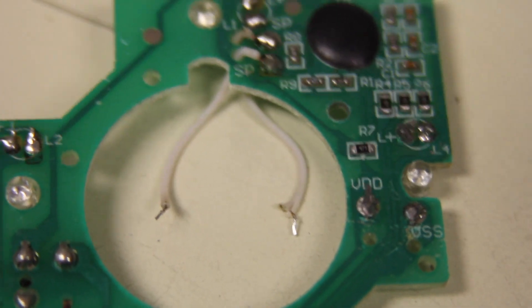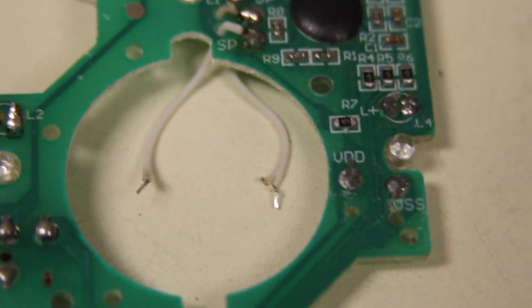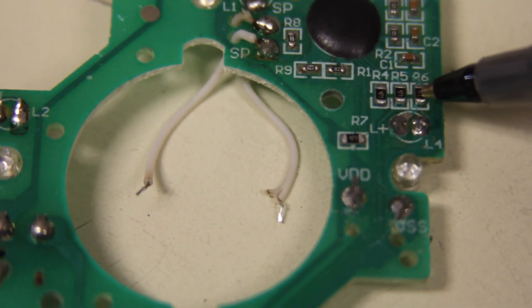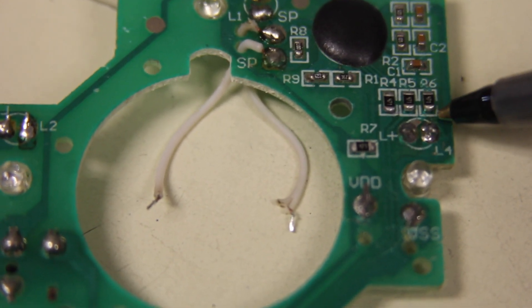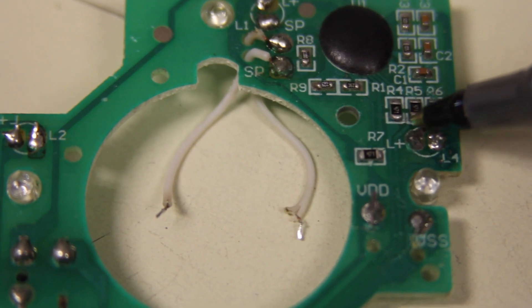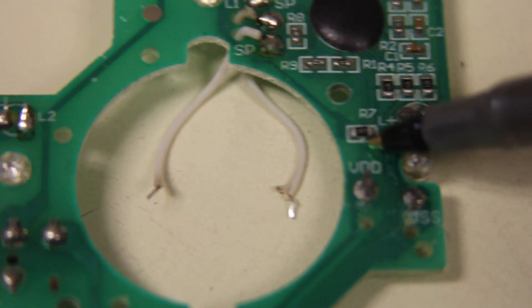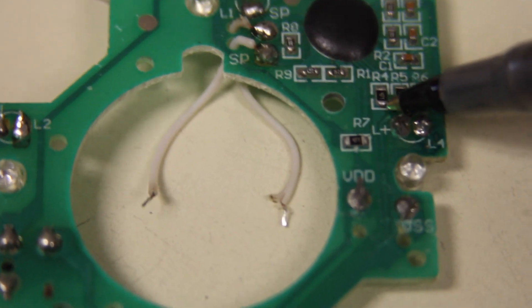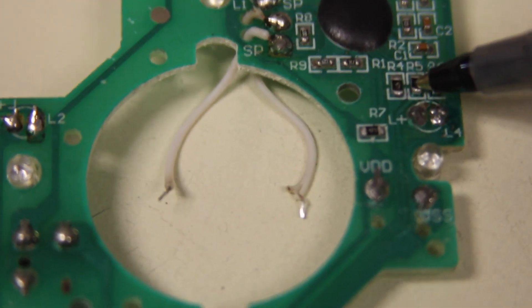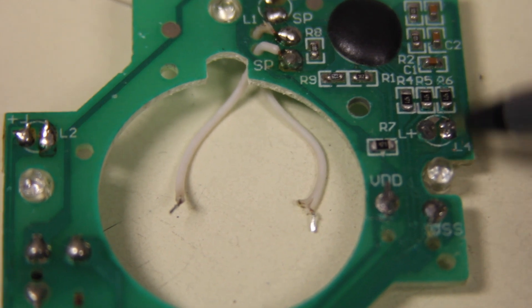The only reason you have resistors there is because the red LEDs can't work at 3 volts — they will pop. So what you do is after you've removed R4, R5, R6, and R7, you bridge with some solder. Just bridge them across so they get connectivity. You can put a little wire or whatever, just so you get a bridge point so the two ends connect on each one. Then once you do that, re-solder it, put it back on, and that's pretty much it.